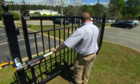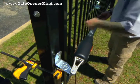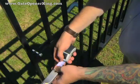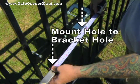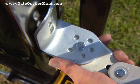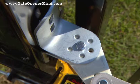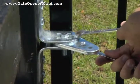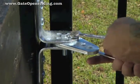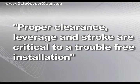Never allow the opener to hang from the post bracket assembly. Visually align the opener with the gate bracket to see if there will be 2 inches of clearance when the gate is closed. At the same time, check to be sure that the distance between the ends of the retracted opener arm and the gate bracket is more than 7 inches but less than 15 inches. If necessary, rotate the post pivot bracket to a position that will give the required clearance and stroke while still allowing one of the post pivot bracket holes to line up with a post bracket hole. You can also turn the post pivot bracket over to give you more adjustment options. When the optimum mounting position is finalized, permanently install the brackets using the hardware provided. Proper clearance, leverage and stroke are critical to a trouble-free installation.